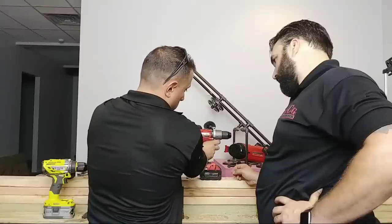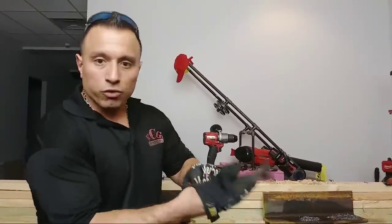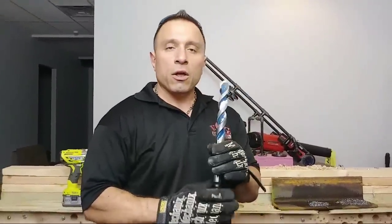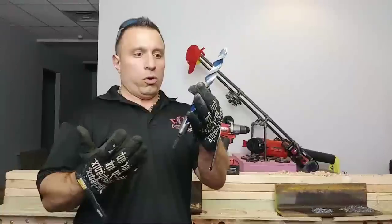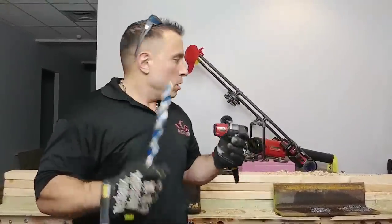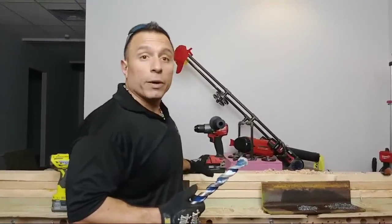But think about the bit. They sell this masonry drill bit, it's a 1-inch bit for 1/2-inch drills. But the reality is there are better tools to drill. You'd be using an SDS. You're not using a hammer drill for a 1-inch bit. So, keep that in mind. But it's part of the testing criteria, so that's what we do. And that's how we do it.